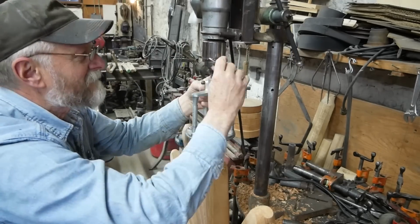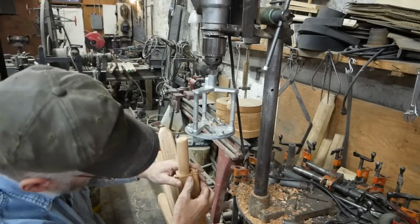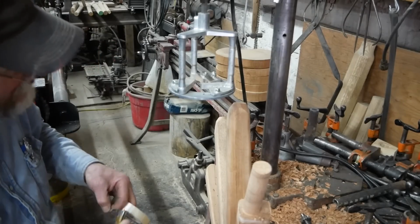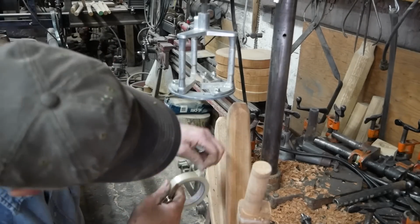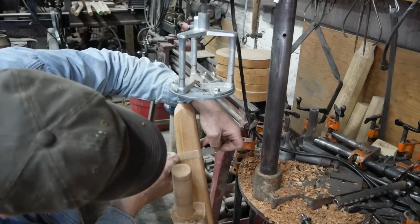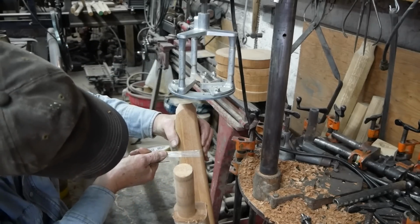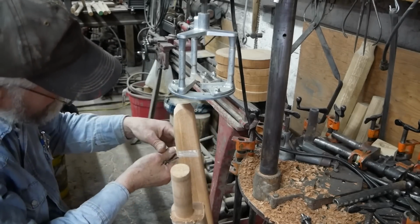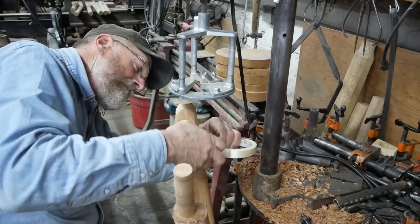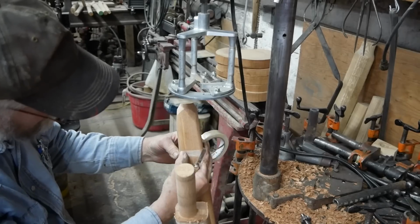Now, there have been several that have asked me in the comments in the past how I like working with this mahogany in the wheels. This is one case where I'd say not so much, as this cutter is cutting cross grain on this mahogany, it's just ripping and tearing big chunks out of it. So I'm going to take some fiberglass filament strapping tape, put it right on the edge of the shoulder that I want, and try to give some support to this fairly soft mahogany wood.